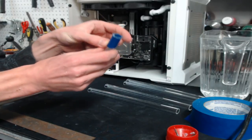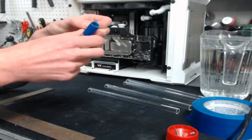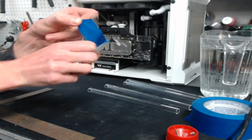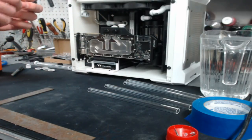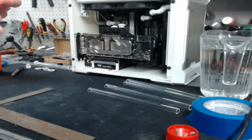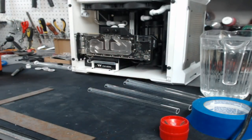That is something that you definitely do. I was using the hand reamer there a little bit, as you guys saw, and you can use it, but you're just going to sit there all night as far as that goes with chamfering acrylic. It's pretty hard compared to PETG. I know for PETG, this is all you need to chamfer it. However, I'll show you guys.